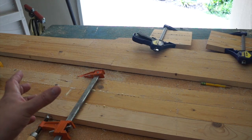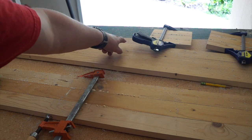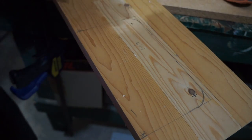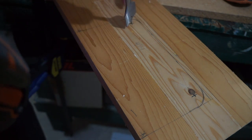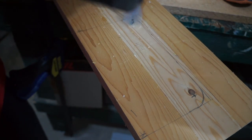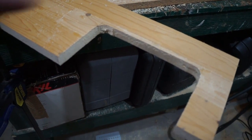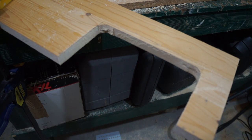Now I've got two columns built into this mantle, so I'm going to take the top inside and mark the edges because I'm going to have to jigsaw those indents out. I marked off where those columns are and I'm using a one and a quarter inch drill bit, measured in five eighths from the top and from the side. I'll start it and then finish it off coming in from the bottom. Here we've got one done — we can clean it up with some sandpaper. That's column one; we'll do the same thing for the other side and then go check the fit.